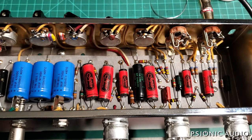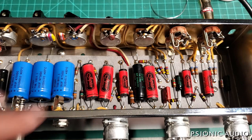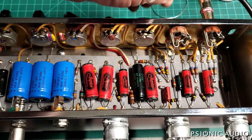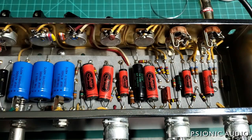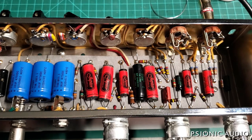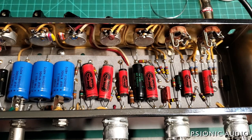At least I've got the DC out of the coupling caps going to the volume pots. The volume pots were also dirty — this one had a lot of noise on it. And the input jack contacts were not great; I had to clean those up. So to the two techs who didn't find anything wrong with this amp — did you even plug anything into it? It amazes me.